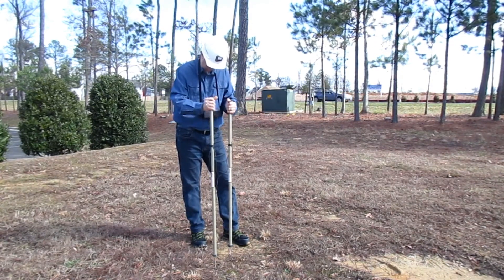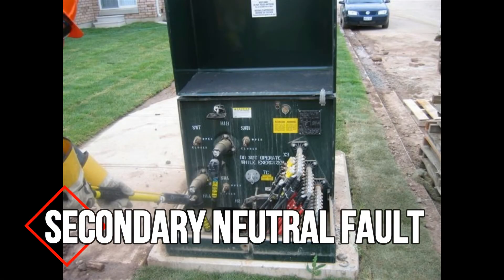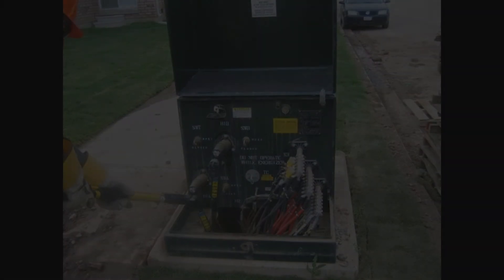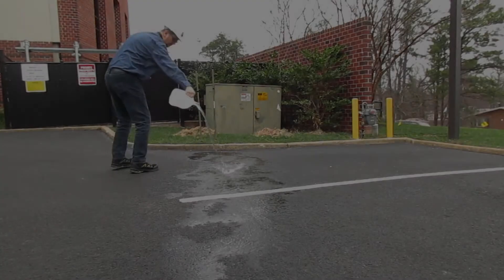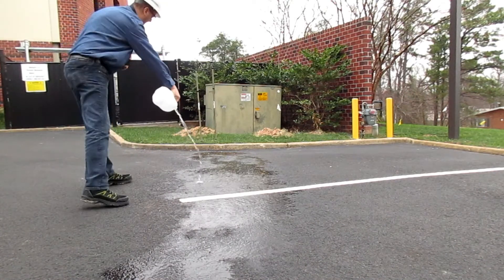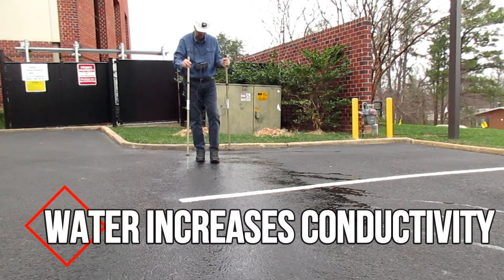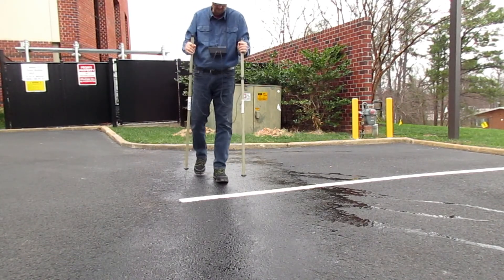You may want to mark this spot for easy identification prior to digging. If you find that you have a secondary neutral fault, you will need to isolate the neutral and then energize it. Then you can probe the cable route again as if it were a secondary phase fault. Be sure to follow company safety procedures when completing this step. Should there be a direct buried secondary cable fault under asphalt or concrete, we recommend that you wet the cable path located under this type of surface. Doing so will make the surface more conductive, allowing the Ross meter to better detect the gradients.